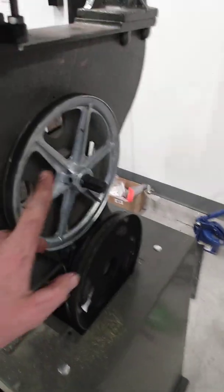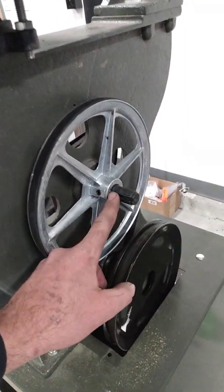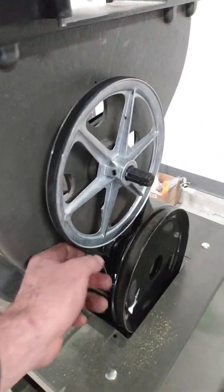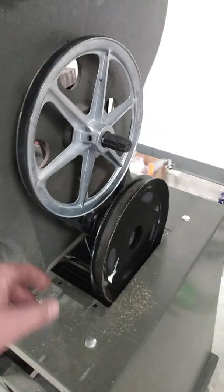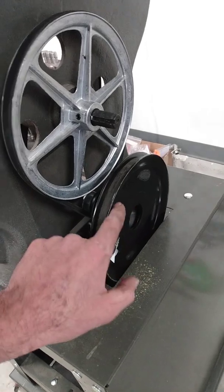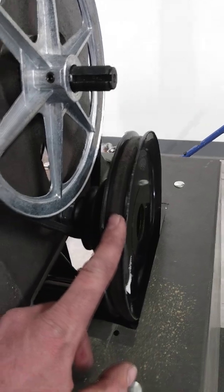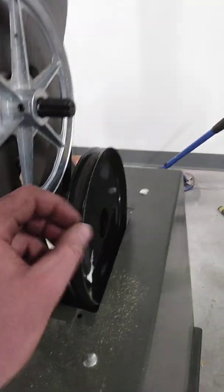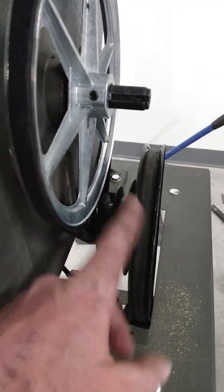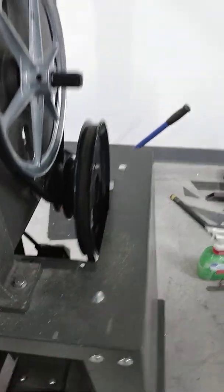One more time for recap: a 9-inch outside diameter, 3/4-inch bore with the key, 4L — that's for the half-inch belt. The belt is 31 inches outside diameter. This other pulley is 8 inches diameter — it looks like it's for a wider belt like 5L, but the bottom groove is narrow enough to run a 4L belt fine. I cut one channel off and welded it.